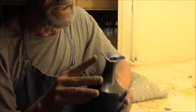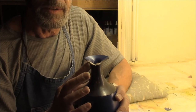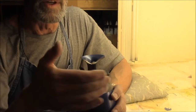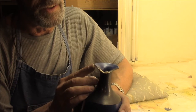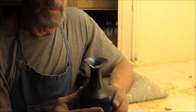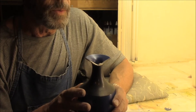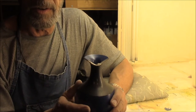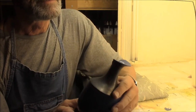I have enough left that I can take a mold of this intact half. It will give me the compound contour of it going around and curved, and I also have it thinner at the edges and thicker at the base. So what I'm going to do is make a mold of this, and from that mold we can fill it with epoxy to build this other half of the bell.